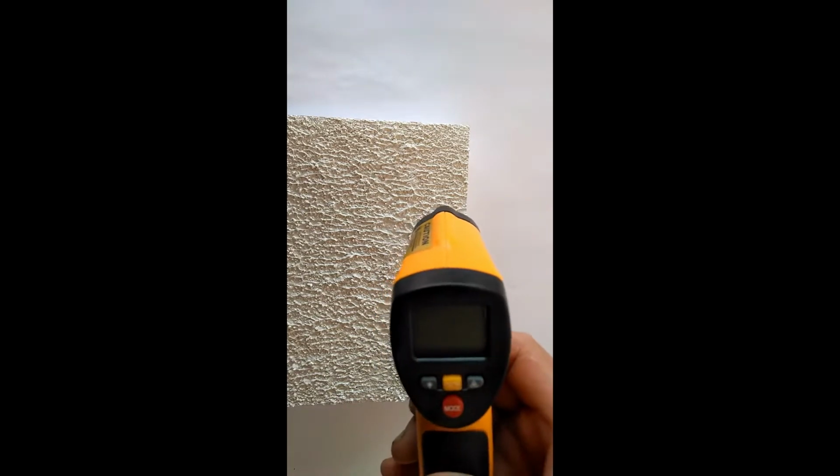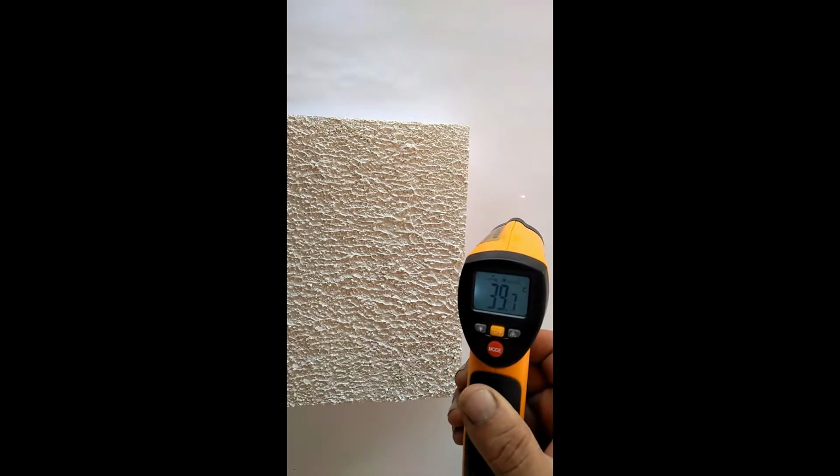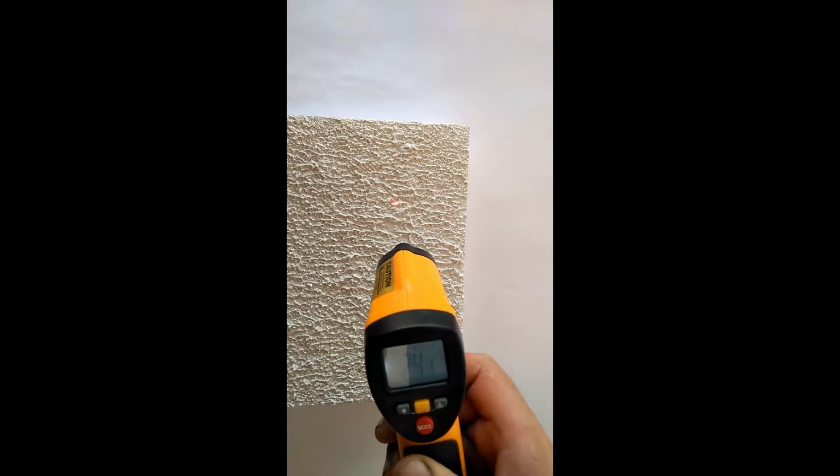Once the samples are ready, a check operation is in order. Today is the 6th of August, 2018 in Córdoba, Spain, and it is 6 p.m. This test is made in the shade. For it we have a digital laser thermometer, and you can appreciate the differences in temperature. 39.6 degrees, compared to 24.1 on one of our sample plates. The sample plate is previously moistened with our nebulizer bottle, therefore it is in the evaporation phase.